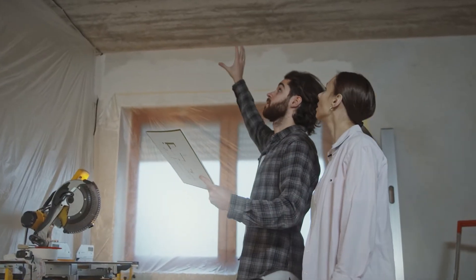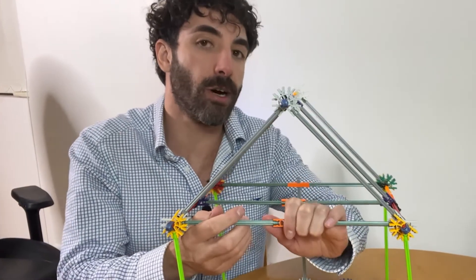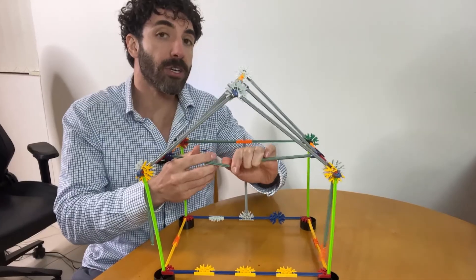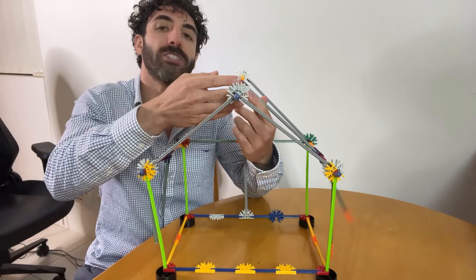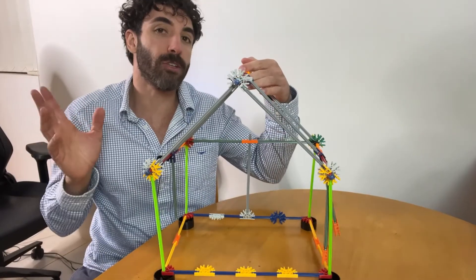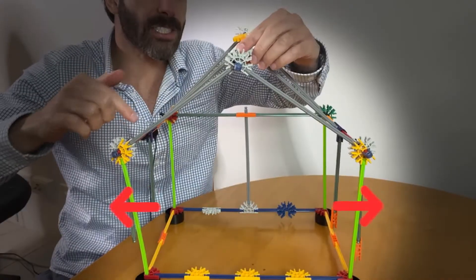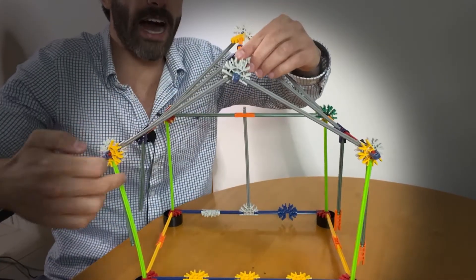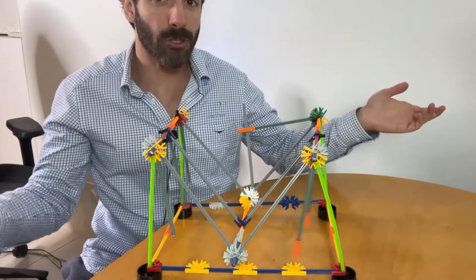So let's suppose you're doing renovation works and you're removing load-bearing walls, and the builder had to cut some ceiling joists and simply didn't nail them back properly together. What's going to happen is that gravity loads from snow, wind, or the self-weight of the roof will push the roof downwards, spread the rafters apart, hence pushing the walls out. And if your roof doesn't crash down like a house of cards, it's going to start sagging and you will see cracks appearing in your walls.